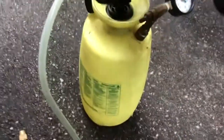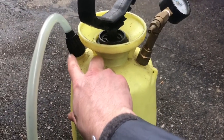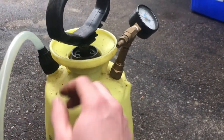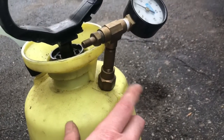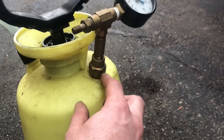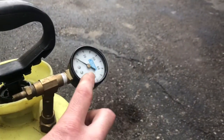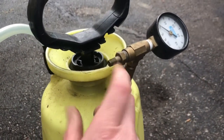What you want to be looking out for is a garden sprayer, either of this size or smaller. It needs to have a pressure release valve on this side. You need a garden sprayer with two orifices, and then you're going to need to go to your local hardware store and get some adapters. I got a female-female coupling of two different sizes, a straight length of copper pipe, and a T with a pressure gauge on one end and a Schrader valve on the other. The Schrader valve is helpful to connect your compressor to it.